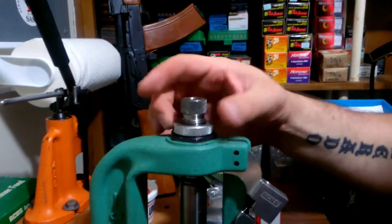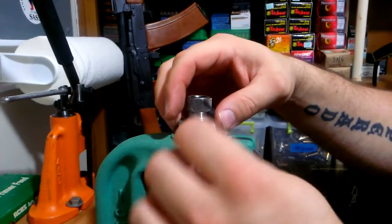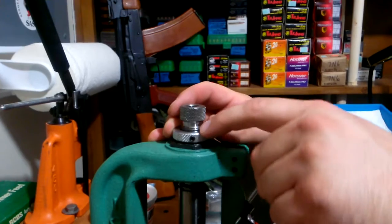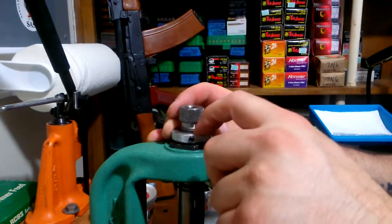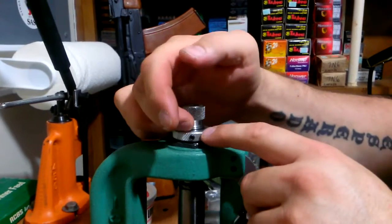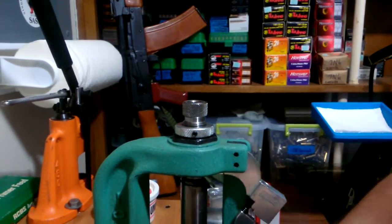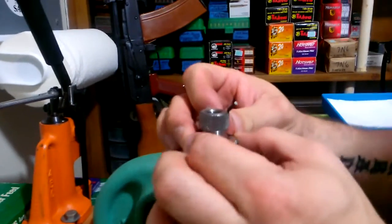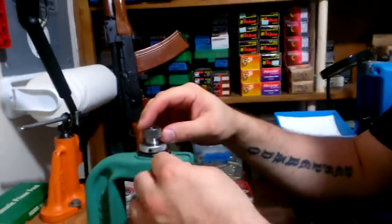And then on this ring, there's a little lock screw. So you would take an Allen key and you would snug it down. Now, different lock rings work different ways. These require you to put a little bit of lead shot inside so that the steel screw doesn't mess up the threads. Some of them have split rings. RCBS makes split rings now, where the ring is actually split here and the screw goes into the ring this way, and as you tighten it, it squeezes around the die body, which is a much nicer setup because it doesn't damage the threads. It doesn't get stuck.